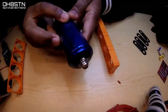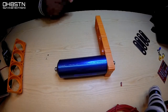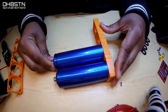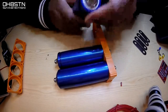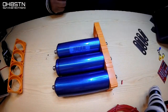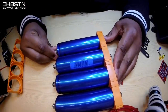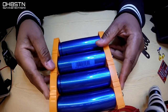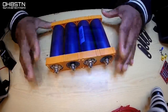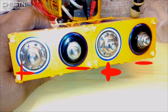Now we're going to start slotting each cell into the battery tray. Hopefully you're not colorblind because the only markings on the cell to determine positive or negative sides are the white or black bands on each end of the cell. Insert your cells into the battery tray alternating positive, negative, positive, negative until you're done. Make sure to push them in as deeply as possible so that they're seated correctly in each tray. When you're done, slide on the other end of the battery tray and push the sides together. Don't forget to check cell polarity — if you're unsure, use a multimeter.